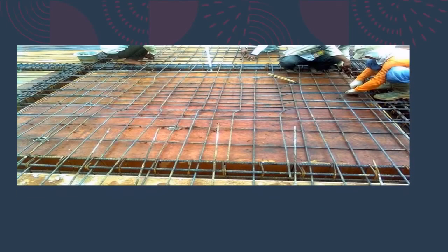Today we're going to learn how to properly connect the footing ground — the concrete encased electrode, often called the UFER ground. There are a couple ways the code allows us to satisfy this ground. We're going to learn that we have to bond and use all available grounding electrodes in the system, so if there are concrete footings or a concrete slab, you're required to utilize it as a grounding electrode.